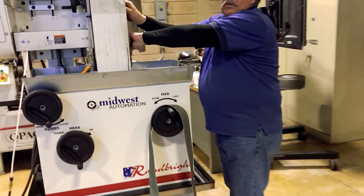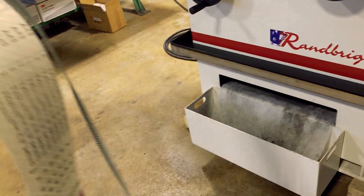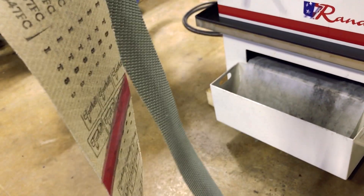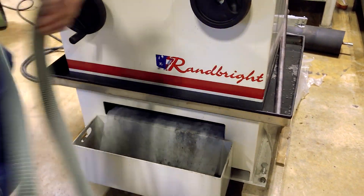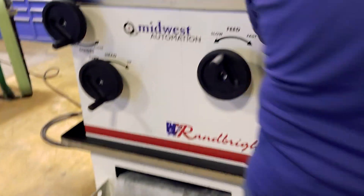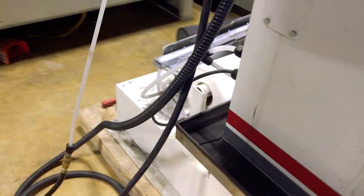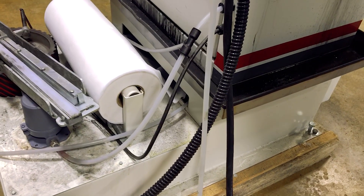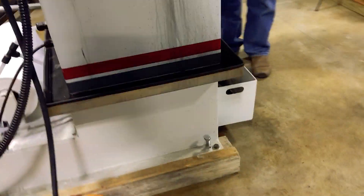Tim's going to go ahead and change the belt. We're going to go to a more traditional aluminum oxide belt — A45 Trizac, that's 347 FC. Some of the standard features on the RB-60 wet machine: we've got a self-advancing paper bed filter, a coolant sump, and we're running a mixture of grinding coolant and water.